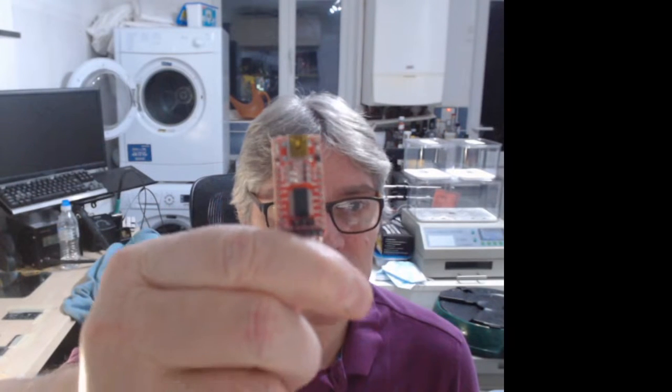So I'm hoping that this weekend I might be able to fix it, because I've received my new FTDI COM port thing, which is what most people use to upgrade their controller software. Because I need it to operate. It won't be possible next week to do the Ice Logic Deck on a hot plate, because it's a double-sided board. Hot plate's only good for single-sided.